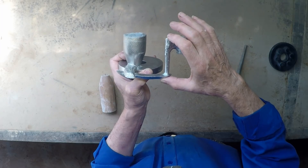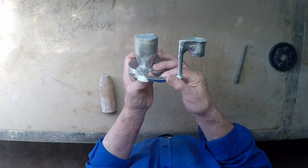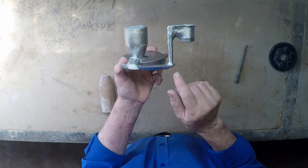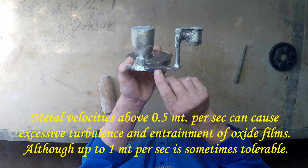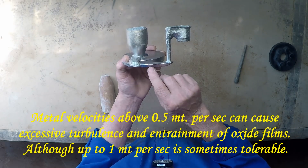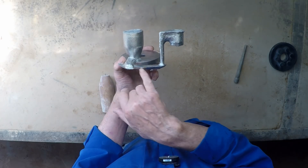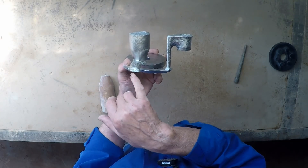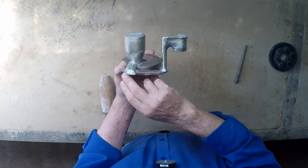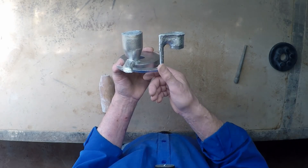This restricts the velocity down the sprue, and that's what we want to do, because most of the time the metal hits the bottom of our moulds much too quickly, and that's not good. I then gate it into a runner bar here, and the runner bar goes along underneath the gate, so the runner bar must fill before the gate actually fills. This is a good thing because it means all the air is pushed out and with luck none of it will get into the casting.